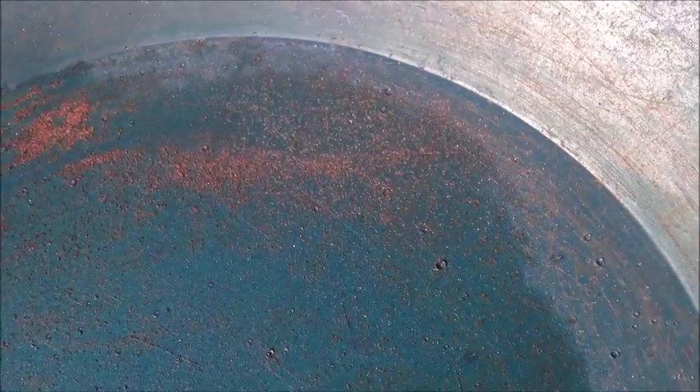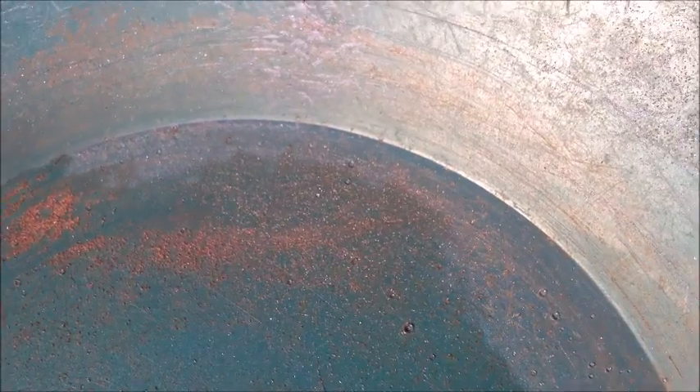There are a few things we can try changing to recover this little bit of fine gold. This table has been set up for ore, so the slope may be a little bit too much. The water flow may have been a little bit too high, and the slurry mixture for the IC chips may not have had quite enough water in it. So it comes out as a big glob and doesn't have time to stratify on the table before it gets washed off. I think we can recover most of this fine gold in a second pass with table tuning, but I wanted to give you the full picture of how it went and the little bit of gold we lost.